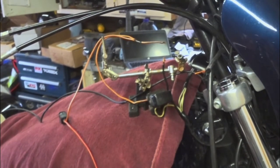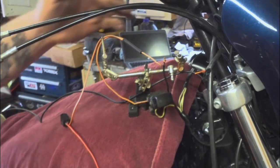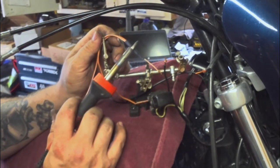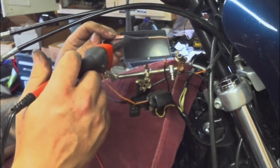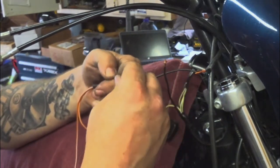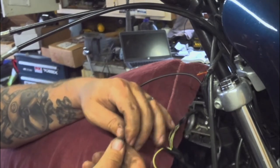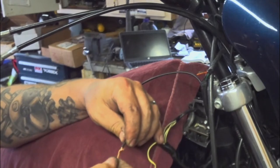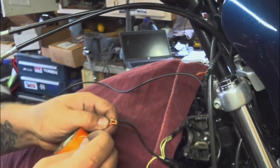Give it a few moments to cool off. Then take some shrink tube, cut it to the appropriate length and size. Most people use a lighter to shrink it — there's nothing wrong with that — but sometimes you have other things in the way. Just use your soldering iron; it's not quite as fast, but it does work. Shrink tube is shrunk. Now we can stretch out that wire we pulled off before, twist it back together to our pull wire, hook it up, and tape it down along with our other wire so it all pulls through appropriately.